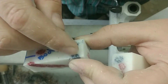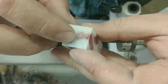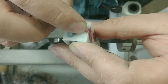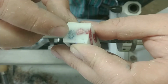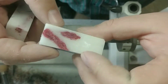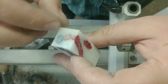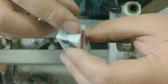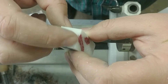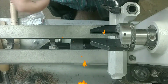But because of those individual strands, when you're cutting those, you do kind of feel it, but they are resin stabilized. And they do cut kind of like a soft to medium hard wood. But you will need to use a CA finish on these. Once you add that CA finish to it, it stabilizes that exterior surface once it's turned, and it is perfectly stable. But you can kind of feel it after you've cut that it is a different texture. All right, let's get these drilled up.